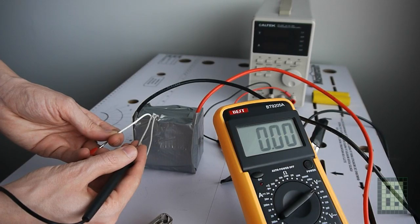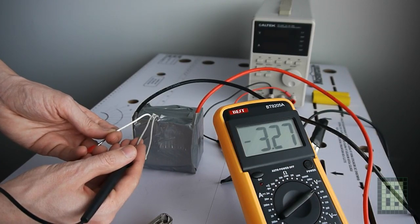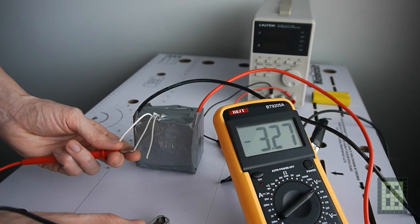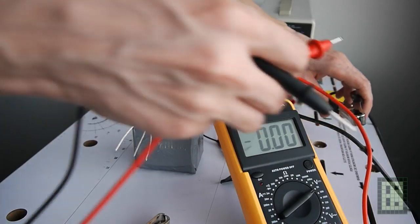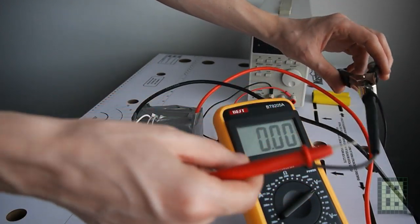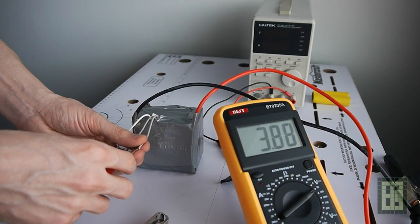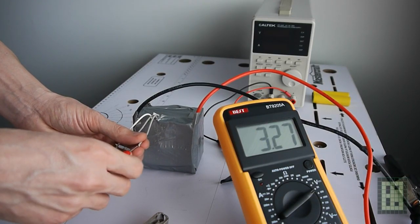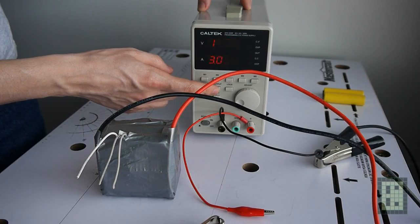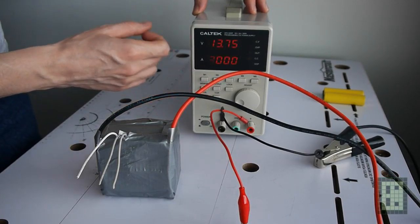As you can see, before charging this battery, I have 3.27V on each group. I do not have a BMS, so I need to manually check the voltage during charging and discharging of this battery. Fully charging this larger battery at 3A will take a little bit more than 1 hour.